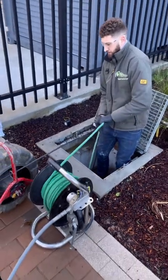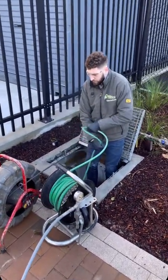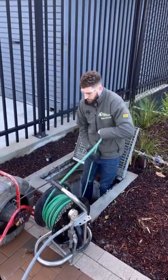The pipe was defective and kept filling with sand falling in via a hole in the PVC. Here I am jetting the line to clear all that sand, which was causing blockages and allowing the stormwater to overflow and pool onto the Sydney Boys High School basketball court.